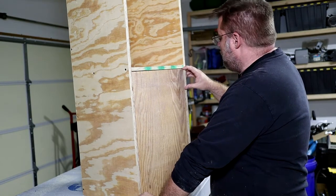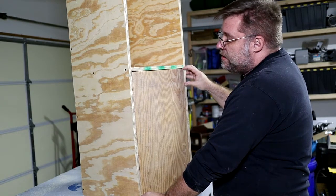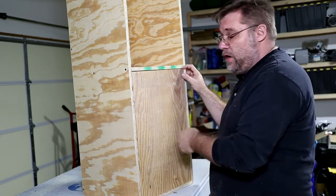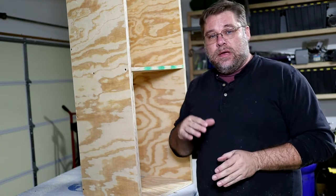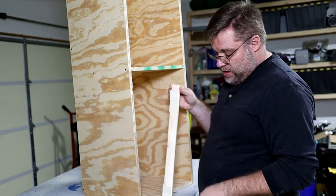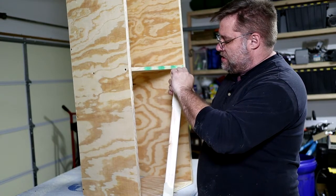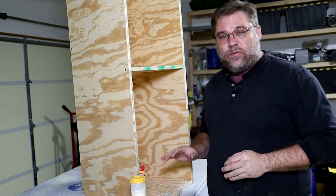This panel is basically going to go on with Velcro or magnets or something along those lines, with just a handle to pull it on and off. The nice part about using the tape with CA glue is it just pulls right off of the wood — then you just peel it off the board you attached it to. This time when I go to attach the board I'm still going to use CA glue to tack it down, but I'm going to fill the rest with regular wood glue.